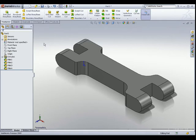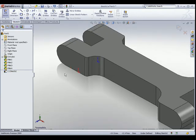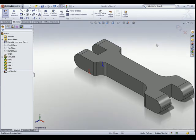Here inside SolidWorks, you can either sketch on the different planes like what you have seen earlier, or you can sketch on any flat face in the model. So for this example, I'm going to sketch on this flat face over here instead of using a plane. So to start a sketch, let me just select a face to sketch on, go to the sketch tab and click on the sketch icon. And straight away, you know that you're in the sketch mode because once again, you can see the red color origin and the confirmation corner. So let me just go normal to this view.